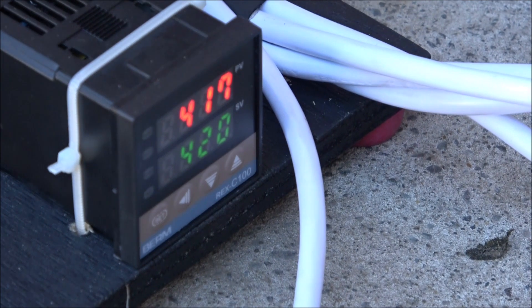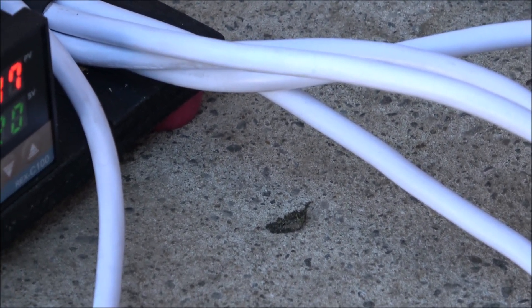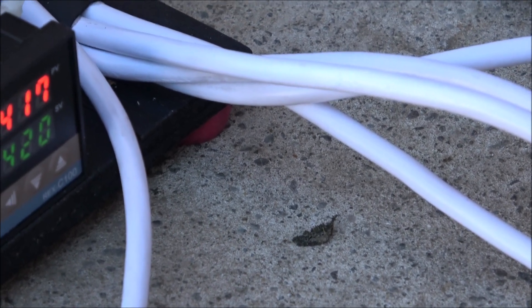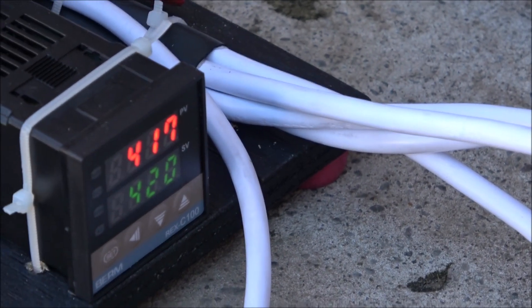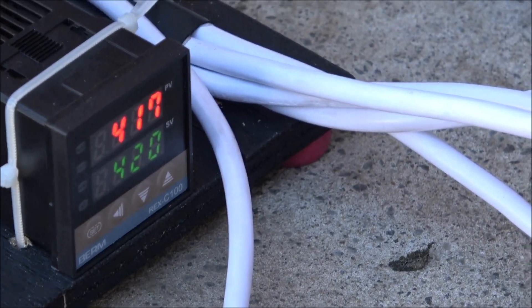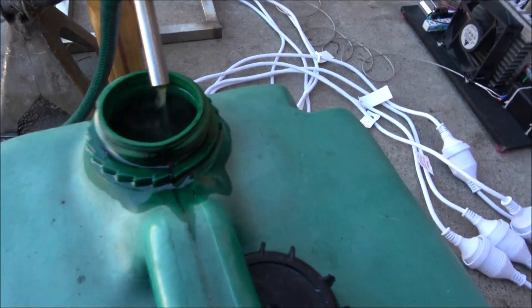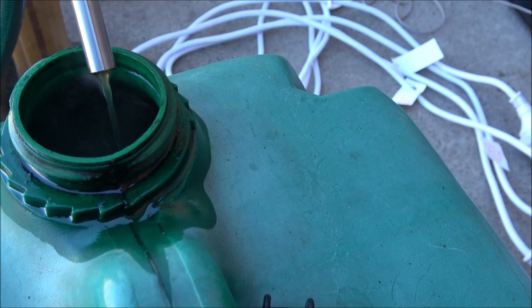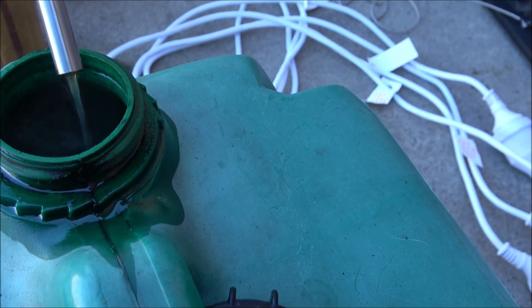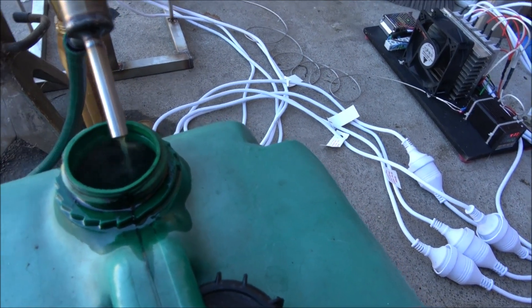I'm now running it at 420°C — it's set at 420 but currently showing 417 because the solid-state relays are switching on and off, creating inertia. Because the oil supply is cooler coming from the preheater, it tends to drop and then rise again, fluctuating within a few degrees all the time. Production has increased, but we've also increased the amount of gases coming out. This is why I don't like processing really heavy dirty oil — you can increase production but you sacrifice the quality.